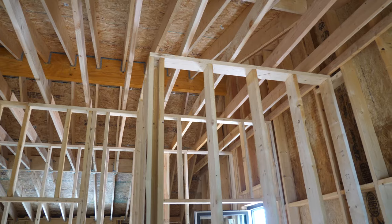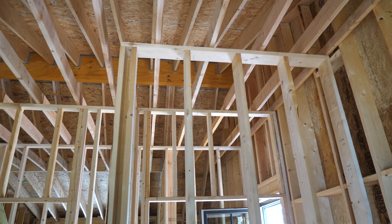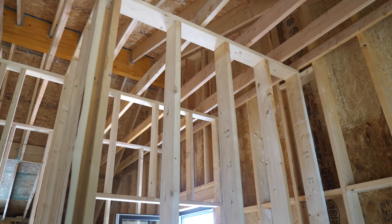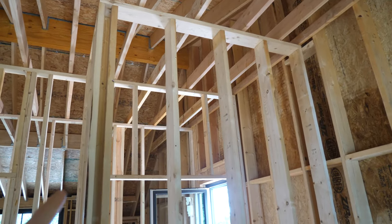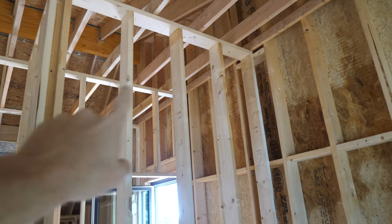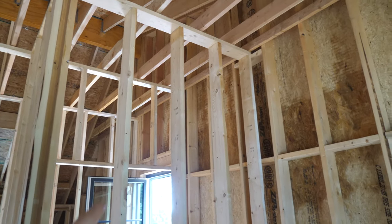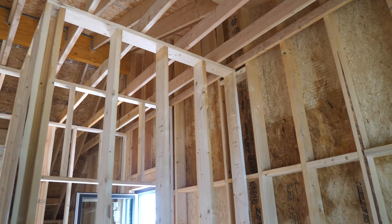The second bit of reframing we have to do is still in the laundry nook, but above it. These are 10-foot ceilings, and we realized that the space above the laundry machines is going to be kind of wasted because you're never really going to be able to access it from the front. But you do have access from the back bedroom, so we figured why not build a little platform basically at the top of that door — take these three studs out and make a platform there. We can use it for storage, maybe put a bunk bed or at least the head of one up there eventually.